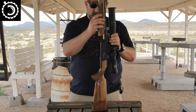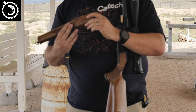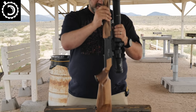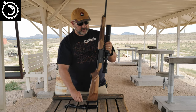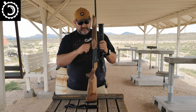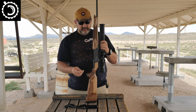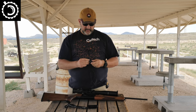The handguard comes back on from the front. Inside the handguard there are two metal guide rods — they're probably what keep it stiff — and they attach to the action, not the barrel, so the handguard is essentially free-floated. This is the only part where there is potentially a little bit of wiggling, but not much. The screw that holds the handguard is captive, so you take the tool and basically just tighten it. I've experimented with tightening it a little differently; you don't need to go all crazy — just a little bit tight.